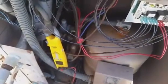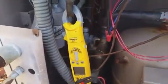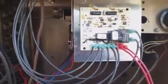So far so good. The fan shuts off, the compressor switches to cooling — it'll hit the reversing valve. My lovely wife called me, but everything worked pretty well. We stayed in defrost for about two minutes, came out of defrost, back into heating. Everything worked as it was supposed to. Happy day.